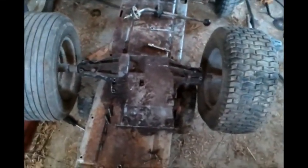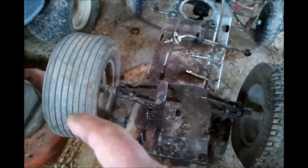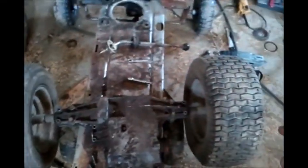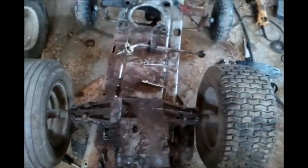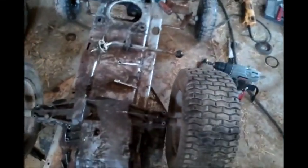And the reason it does that is so that when you're mowing the lawn and everything, it doesn't grab on both sides equally. So if you turn a corner, the distance on the outside of that corner is going to be farther than the inside. So the inside wheel would travel less and actually have to spin a little bit if they were fixed one rotation on each side, and that would dig up your grass. You don't really want that.